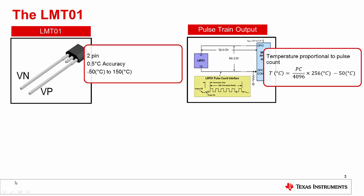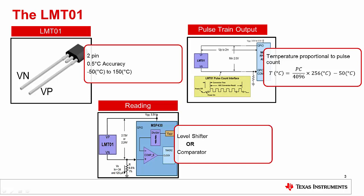Because these pulses are current-based, it is necessary to include some additional circuitry in order to produce a voltage that is readable by the Arduino Uno. There are two ways to convert this pulse train. One is with a level shifter — by including a BJT in a pull-up or pull-down resistor, the current output can be converted to a pulse train which goes between ground and the rail voltage. We won't be using this method today, but several examples are shown in the LMT01 data sheet. The second option is to use a comparator, and because the Arduino Uno has a built-in comparator, we'll be using this method. It requires much less external circuitry, and only an external resistor is necessary to convert the current output to a voltage.